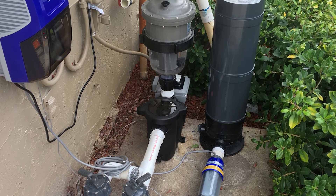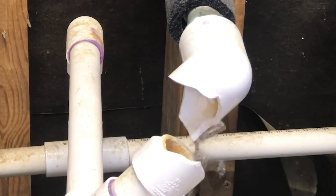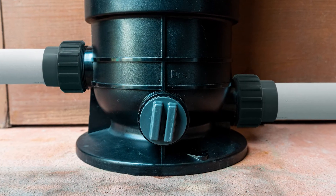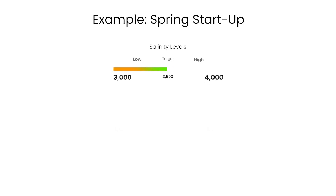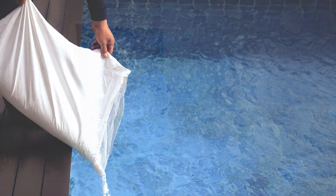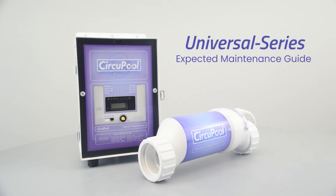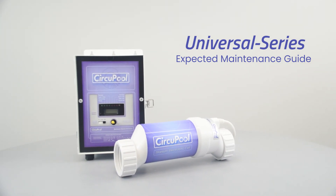The electrolytic cell will be damaged by freezing water just as your pool plumbing would. In areas which experience severe or extended periods of freezing temperatures, be sure to protect your pool equipment and plumbing. This may include draining all water from the pump, filter, supply, and return lines before any freezing conditions occur. When opening the pool after a period of inactivity, do not power on and use the chlorine generator until the pool's water chemistry has been balanced and brought to ideal levels. Salt must be added if water has been drained over the winter. Thank you for choosing CircuPool Advanced Pool Systems.